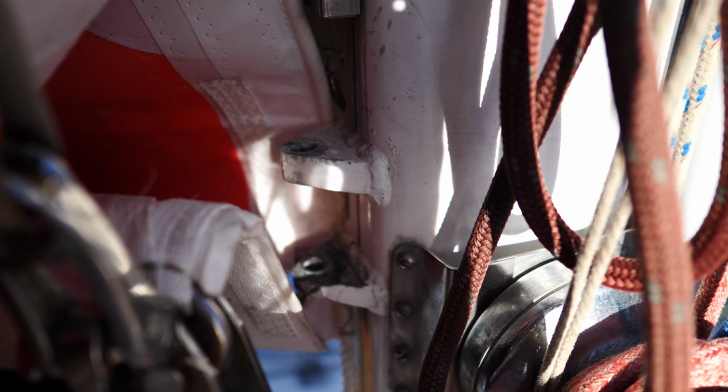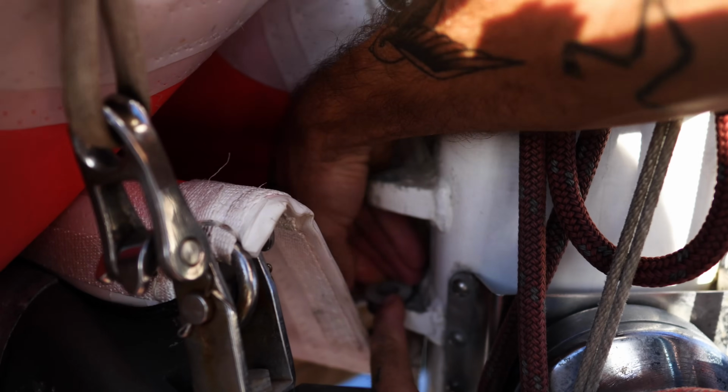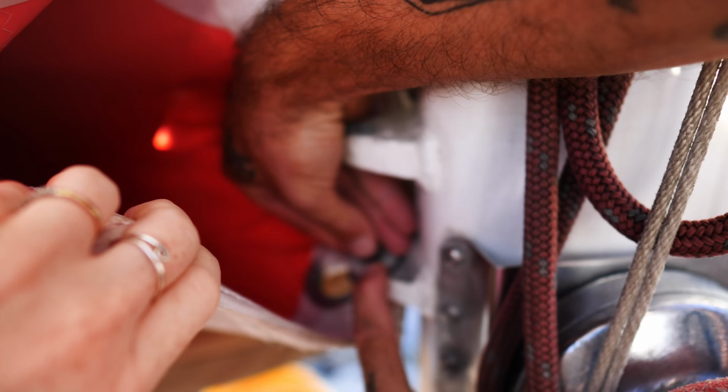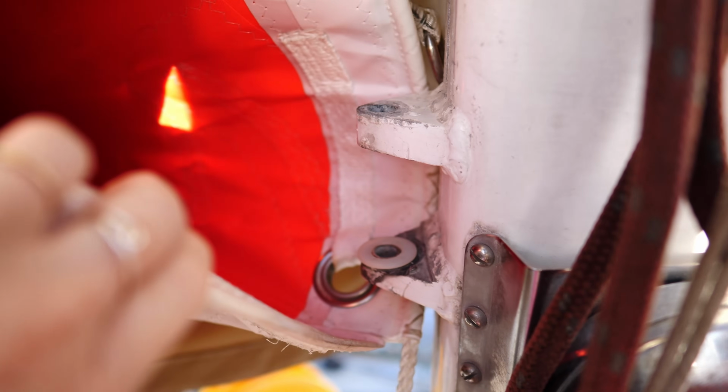So close, so close. So we were actually in our Patreon chat, there's a number of Sabre owners, and there's actually supposed to be 2 washers that are plastic top and bottom on this boom that we lost years ago. So that's probably what this damage was caused by. I didn't know to be looking for a bushing to be in place. So we're basically replicating that right now. The damage isn't that deep. Or on the back end there. Yep. It's below the sleeve, so I think we might be all right to do a fit.